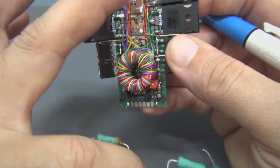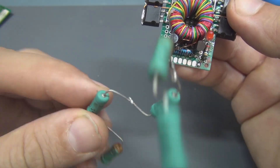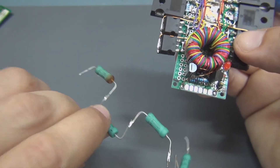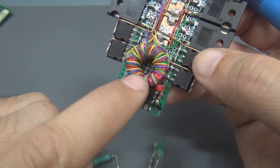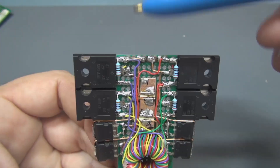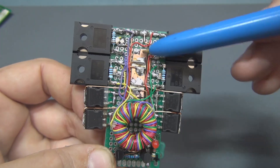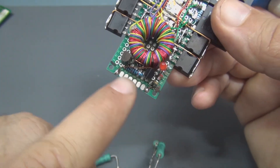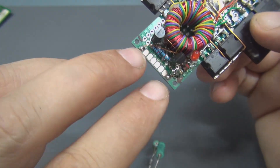I prefer to use this driver on the 12 volts coming from the power supply rather than using the high voltage from the capacitor banks, because there is a lot of energy loss. It uses about 6 watts of energy just to supply this oscillator. So I prefer a mono-rail high-voltage entry and a separate supply for this little oscillator coming from the same power supply as the boost converters.